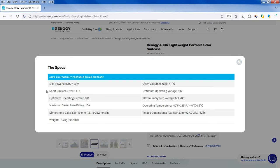Be careful. Okay, so you have max power is 400 watts. Now, I've seen it get up in the other reviews up to about 350-ish area, which is fair. I would like to see, obviously, the 400 like everyone else, but the way they rate these panels, guys, is they rate them in a laboratory where every condition is perfect. The light, the temperature, the wind, there's no wind, you know what I mean? So everything has to be perfect for them to get that 400 watt rating. And then they bring it into what we call the real world, and then you set it up and you go, well, I only get 349 watts. Well, that's the game, unfortunately, because we don't live in a laboratory, in a controlled environment. It would be nice if we had weather like that, but not so lucky.